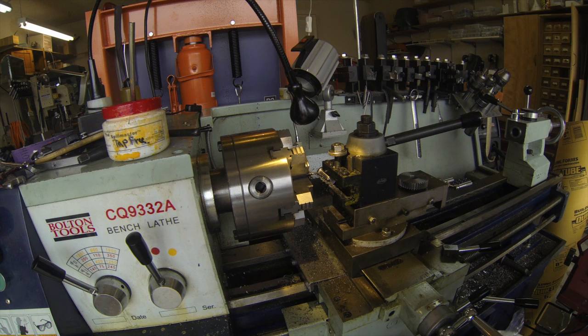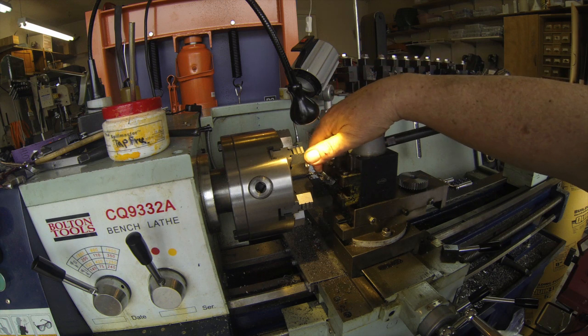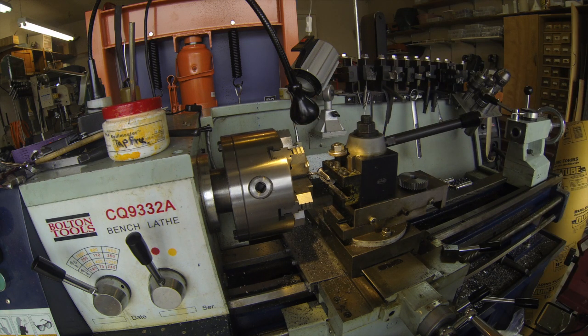So what I'm doing here, and I'm just about finished with it, is making the bushing. I turned down a piece about an inch and a quarter long and left a little step at the top to sit down on the face of the gear. I've got a 3/16 cutter in the mill, and I'm cutting the slot just right at 3/16 deep. I think this is going to be the last pass, so we're going to turn things on here and let her rip.